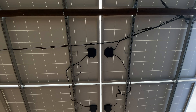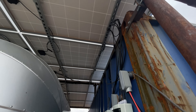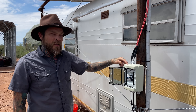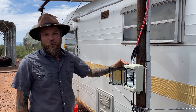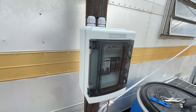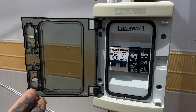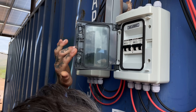I've got 24 panels powering the inverters and charging the batteries, arranged in four separate legs of six panels each — six in series, four parallel legs going directly into the inverters. We got three PV disconnect boxes so we can switch the panels off from what they're running. One box handles a single leg dedicated to our solar-powered air conditioner, which goes straight to the AC system and bypasses the battery room.